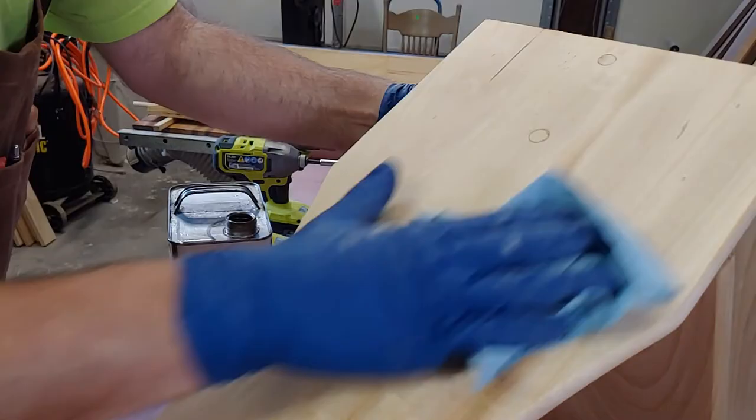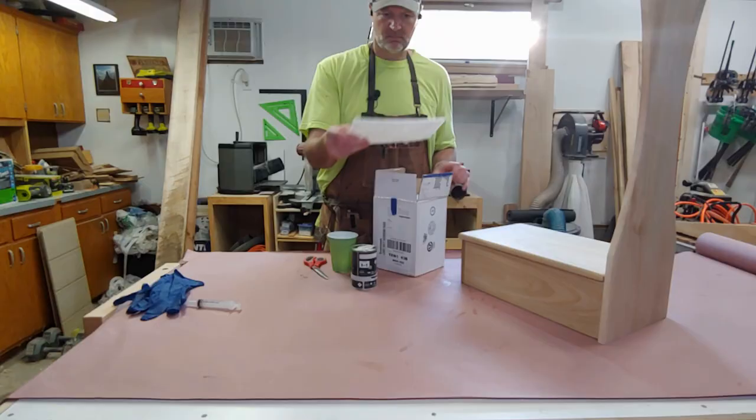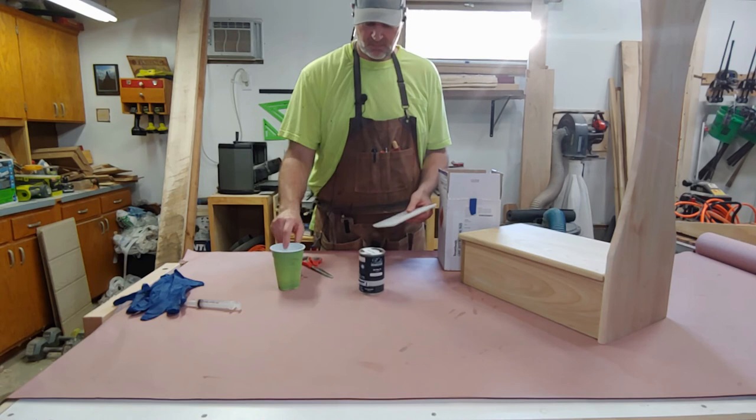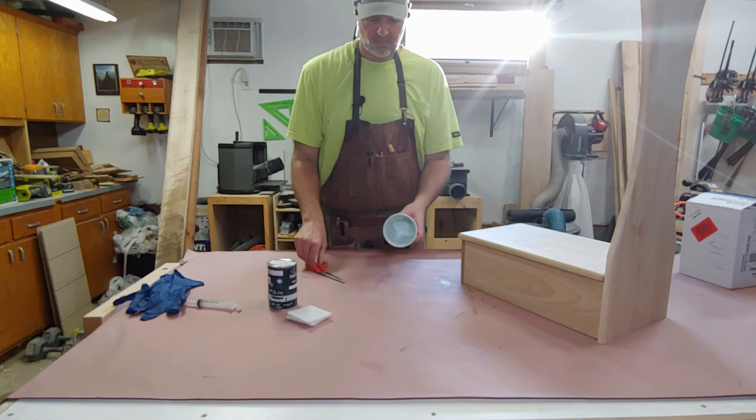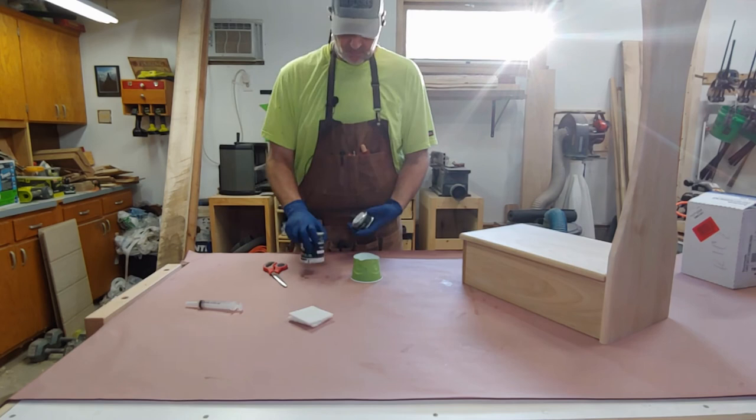A little mineral spirits to clean up the sawdust and make it look clean. Now — Rubio Monocoat. I know I'm gonna hear 'it's so expensive' — whatever, use it. It's the easiest finish there is. I take a solo cup, cut it in half, flip it over so it won't tip. I mix the Monocoat — this is chocolate color — there's Part A and Part B in a three-to-one mixture. Mix them in that little solo cup using a small syringe.